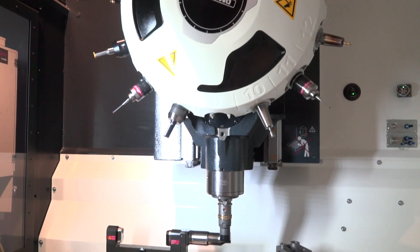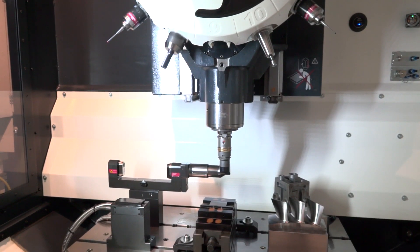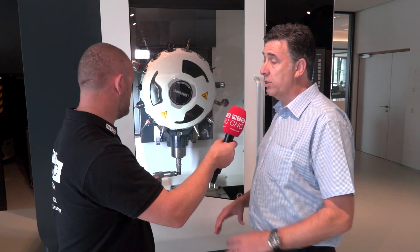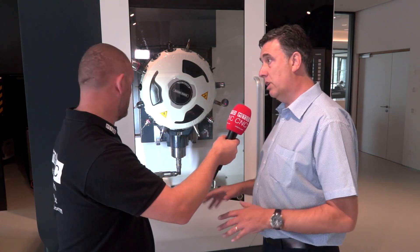So why is it all integrated into one piece? Some older technology could measure this equally as well, but effectively we're looking at two separate products — a laser control and a tactile tool-setting system. Having two independent units creates a difference in calibration positions, so you'd get a mismatch between milling and turning tools. The beauty of the LC52 is that it's one combined unit using one skip signal and one set of calibration data, tying both systems together so you get stable, controlled measurement across both your milling and turning tools.